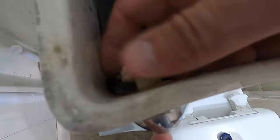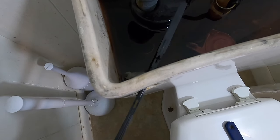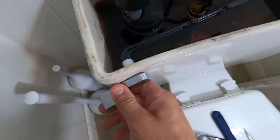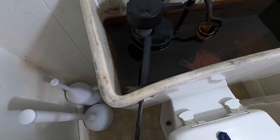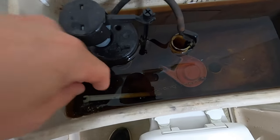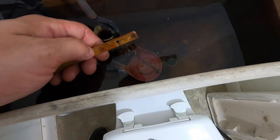Take this off — there's your nut — then you take this out. If it was broken a different way, basically this would be in here like this and you would just have to snake it out just like that. Now I need to retrieve the old handle. Don't worry, this isn't sewer water or anything, so you can put your hand in here. This never touches the bowl — well it touches the bowl, but it's not dirty basically.